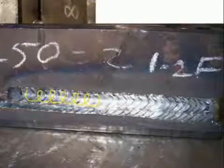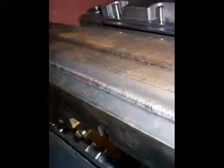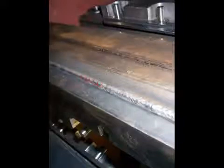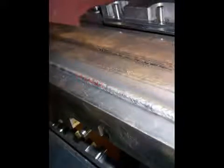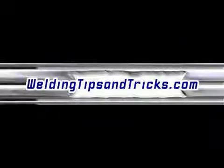It works on multi-pass welds just as well as single-pass welds — anything horizontal, overhead, flat. Another little tip: if you want to pick up your travel speed, don't overlap into the puddle. Just pause slightly at the top and make a series of U's not overlapping into the puddle at all, and you'll actually pick up your travel speed by about 50%. This particular part, sometimes I do about 20 of them — they're about 1-inch steel welded to 1/4-inch tubing, 18 inches long by about 4 inches, and I've got to weld them all the way around, so that's a good tip for you. Thanks for watching.